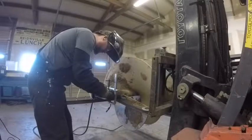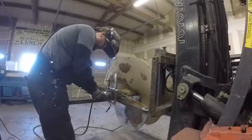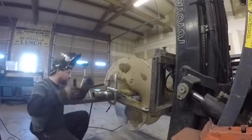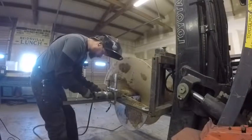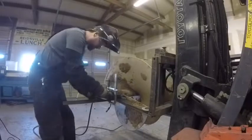So with channel iron, you've got the flat surface, and it works really well because it cups the pipe perfectly. So what we're doing here, I've got the channel iron. Like I said, it's just a 2-inch piece. You could probably use an inch and a half and it would be okay, but 2-inch works pretty good for a 4-inch pipe. And so what we've done, we've clamped it onto the shaft coming out of the auger,